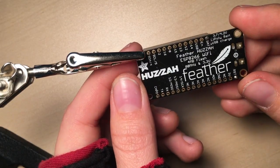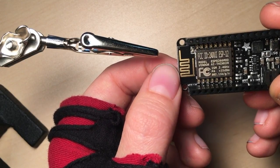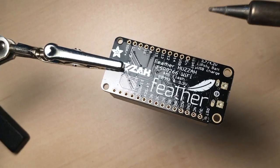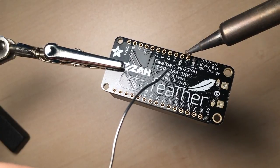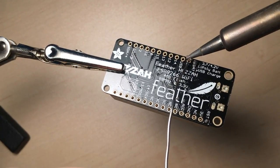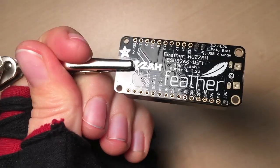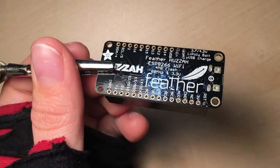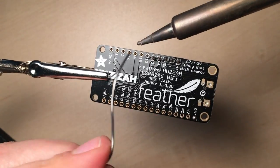My next step is to solder the rest of the pins in. I'm going to clip it into this third hand, which comes with a magnifying glass and two alligator clips to hold stuff together. I'm going to be clipping directly on top of the antenna of the built-in ESP8266 module, which I think will be okay as long as I'm gentle. My soldering iron has a little bit of solder on the tip — that helps make good thermal contact. I'm going to snug it up against one of the pins and sockets and bring in the solder from the other side. I add just enough to get a nice little cone of solder — it should be concave on all sides, but you still can't see any of the socket around it. Bringing the iron and the solder in from opposite directions makes it so that the solder sticks to your circuit and not to the iron.